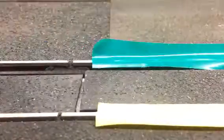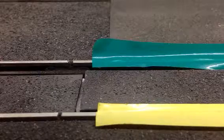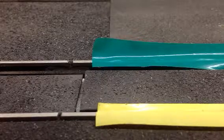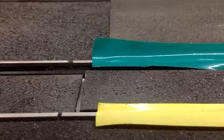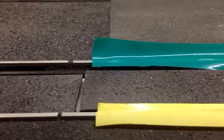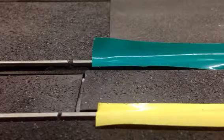And again, that's simulating the speaker, but in a slightly more sophisticated way, which is actually quite useful because if you're working away somewhere, you can actually have the buzzer on. If you feel the track join is somewhere a long way away, or there's some problem with your wiring, you can actually have that sat on the track, play around until you actually get your buzz, and then you know you've resolved the problem.